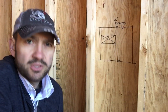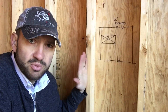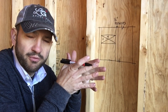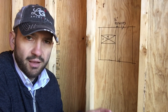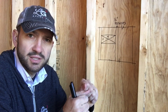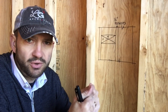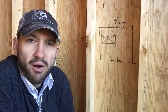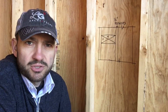So why are we doing 12 inches on center? Well, again it's the shear wall. With the half-inch plywood and 12 inches on center we've got this really robust shear wall to prevent this home from moving from side to side, which helps with durability. It helps make sure that all the materials aren't moving around and weakening joints, and allows those tightly sealed cracks, joints, penetrations, and things from moving around and then opening back up and losing the continuous air barrier that we have around the structure.